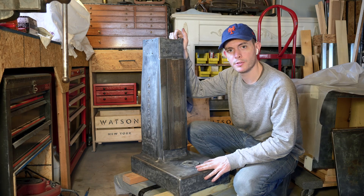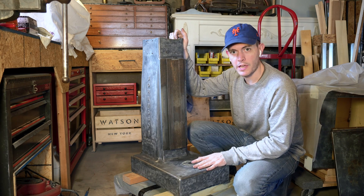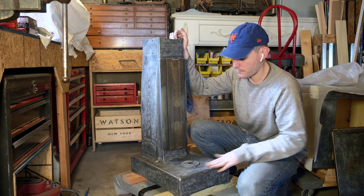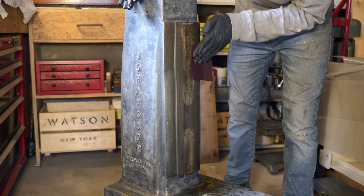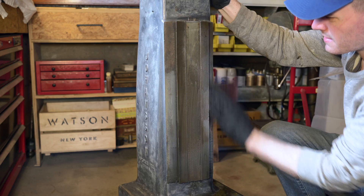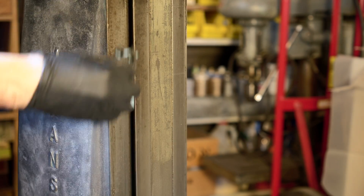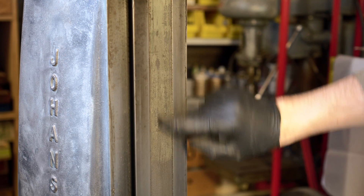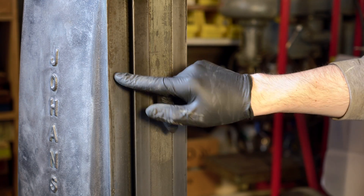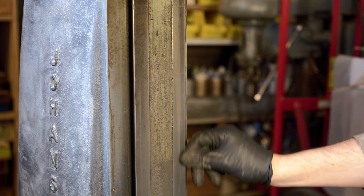I'm giving it the same treatment with the wire brush and I'm probably gonna end up having to do some filling on here, but I didn't touch these machine surfaces with the angle grinder. So now I'm gonna clean these up gently, mask them off, and then hit this with some filler primer and then probably some filler. Looks like this was actually scraped and this centerline was painted, so I'm gonna strip this and paint that again. I'm gonna try some Barkeeper's Friend on this — I think that's gonna clean it up pretty quickly. That was just mineral spirits — it's in pretty good shape.